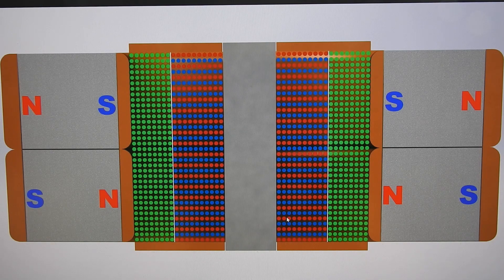What you see here is a cross section of the magnet array that you just saw. This magnet array consists of 2 ring magnets or ring arrays. In the top array you can see all south poles are facing inwards, and in the bottom array all north poles are facing inwards. In the center we have our steel core with 3 coils wound around it. I have marked 3 different coils in 3 different colors: red, blue, and green. The 2 center coils are wound in a bifilar arrangement, and for now I have connected them in a parallel configuration to my audio amplifier.